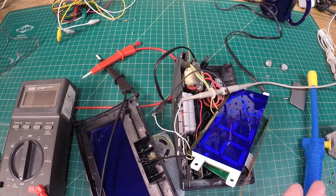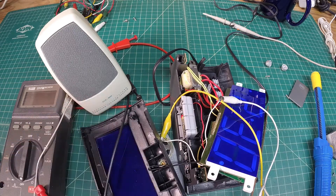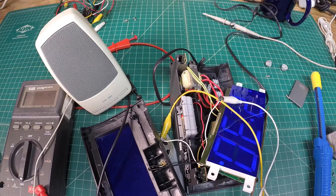It looks like there's audio output because the reminder assistant is asking me for a response. Back with you — I checked all the electrolytics, tidied up the solder joints, and the problem itself resides in the speaker output. With this temporary speaker in place, let's give it a test. 'Reminder assistant.' 'Can I help you?' 'Set time.' 'Please tell me the time including AM or PM.' '3:30 PM.' 'The time is set to 3:30 PM.' That's great news!